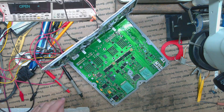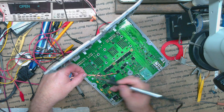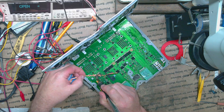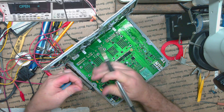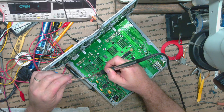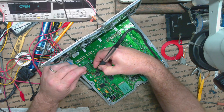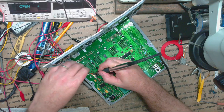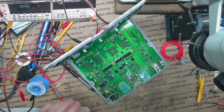Should be easy to fix. Let's clean up all this first. I'm going to take this off and just clean up everything using some solder wick and some flux. This should be pretty straightforward to clean up and get it fixed. I'm using a pretty big tip here on a Metcal CV-5200, which can put out some pretty good power. It looks like I sucked up the capacitors — nope, no capacitors there. It looks like they got knocked off. It's not really a big deal that they're not there; they're just filtering capacitors where the battery voltage comes in, and there are plenty of them.